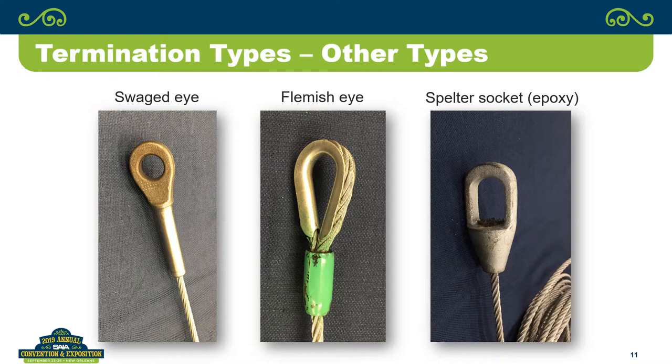Traditionally in our industry, Spider's 15-inch braided back into itself eye was called a Flemish Eye. And that's what I've always understood that to be, braided back into itself, not seized with wire, anything like that. The guys at I&I Sling call what you have there a Molly Hogan. They don't take the wire and put it back into the sleeve. They separate it and then twist it back into itself, which you can't do with 5-strand wire. The old 6x19, 6x31, you could do that, but it doesn't work as well when you have an odd number of strands going back in. We do it with 5x26 and make Flemish Eyes, but just like that. Yeah. I think they're both Flemish Eyes, actually.